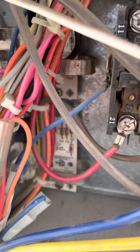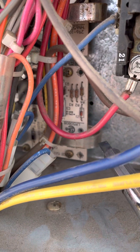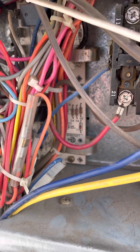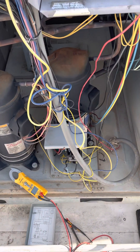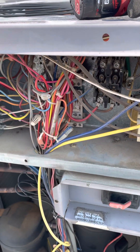You'll also see a metal ring on the board — that metal ring monitors the current of the compressor. I believe these boards also lock out if the current gets too high. If the compressors are amping too high, it can also put your system in lockout.